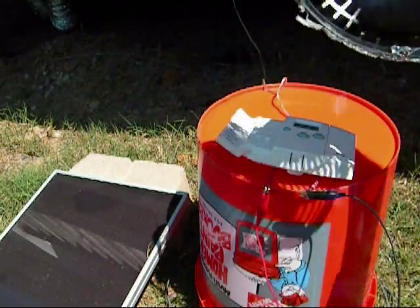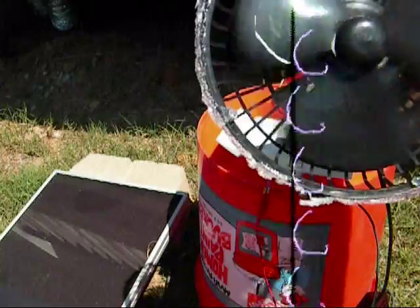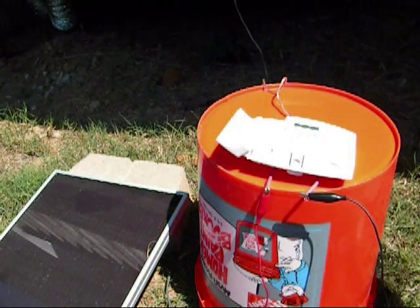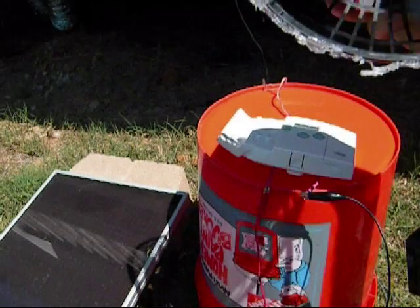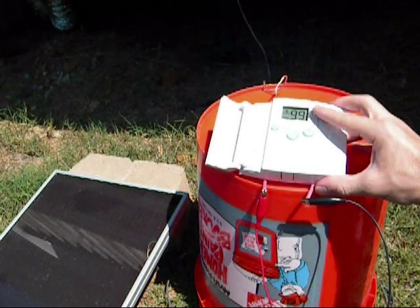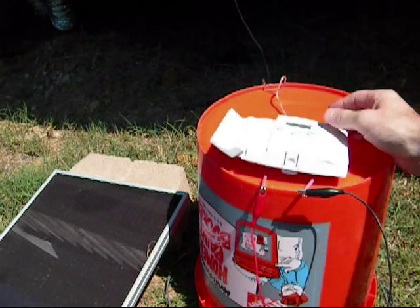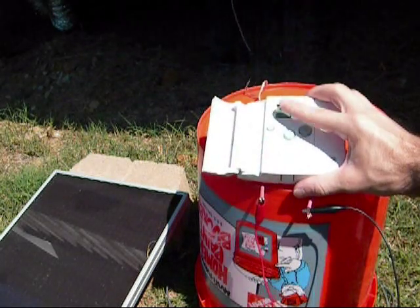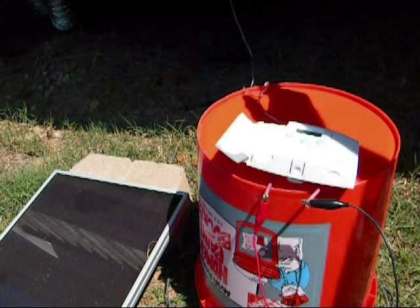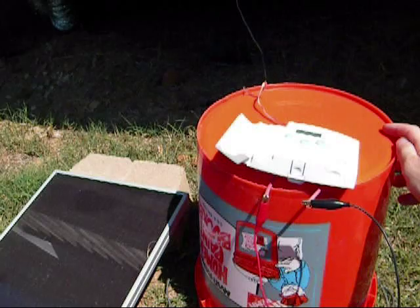It thinks it's just too hot and needs to blow air into your house, so let me go ahead and turn that back on — there's a little on/off switch. See, works great. But I wouldn't suggest using these car fans because they are so loud — we just stopped using them and switched to computer fans. I hope that helps everybody who had questions about how to hook up your thermostat to your solar heater. The main thing is taking your heat sensor out, wiring it up to something like speaker wire, and sticking it in your solar heater. Thank you for watching, take care, and God bless.